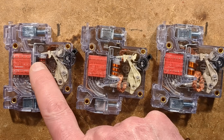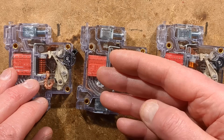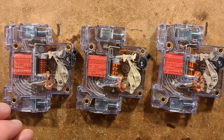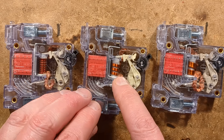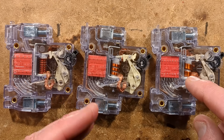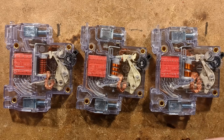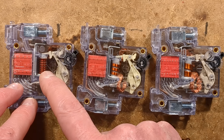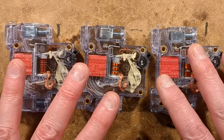These three circuit breakers are rated 16 amp, 32 and 63 amp. The main high-speed trip requires 10 times the rating to trip them magnetically. There's a bimetallic strip in here as well, but the main high-speed trip is based on a little solenoid. Depending on the current rating, the 16 amp has eight turns, the 32 amp is three turns, and the 63 amp has just over one turn. You might think that's not really going to activate a solenoid, but under fault conditions the 16 amp requires about 160 amps to trigger mechanically, the 32 requires 320 amps, and the 63 about 630 amps. So those couple of turns are ample for creating that force.